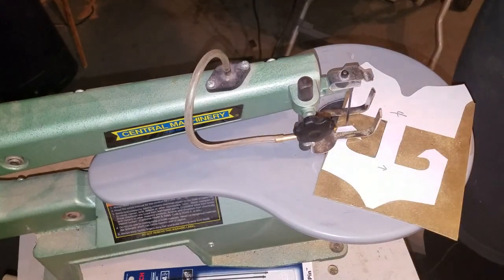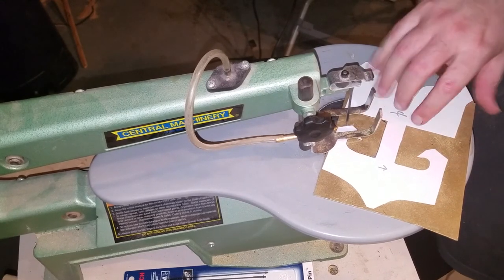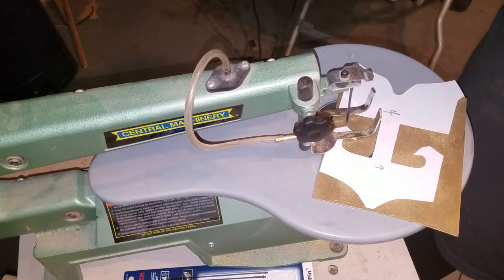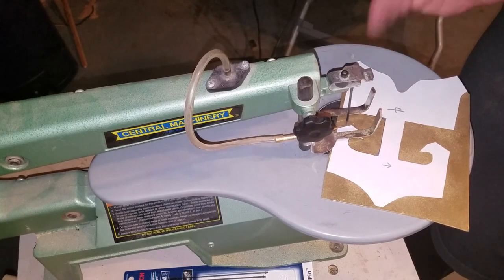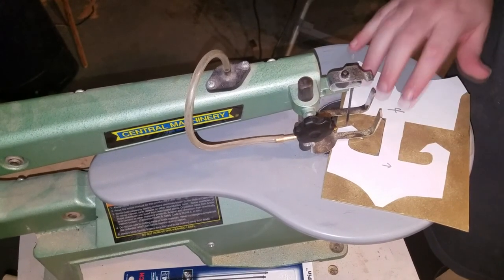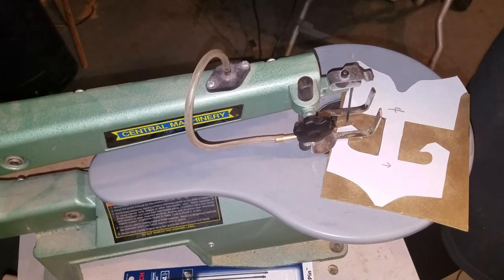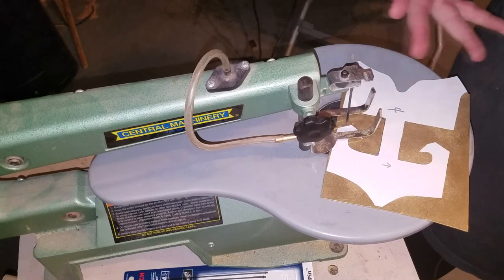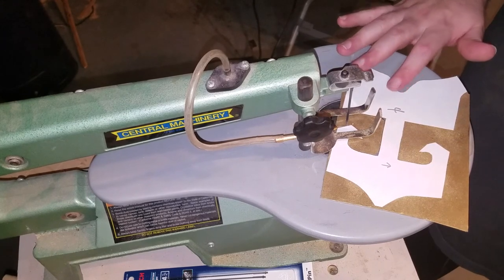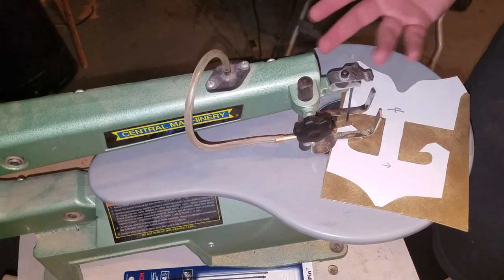Okay, that was real time, and now I have to create that same groove that I made right here, so I can turn the blade, because I can't turn it at a hard angle without flexing that blade, and I don't want to do that with the arm moving, which is another thing that causes it to snap. Now, as a warning, I've cut this piece already in half, and these blades have been barely lasting me one cut. So just to be perfectly honest, this is a constant learning experience. I'm constantly learning to cut new materials because I could use one blade on wood all day and all night, but now I'm doing metal, and it behaves differently.